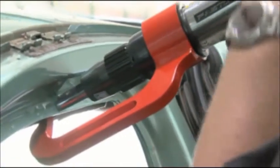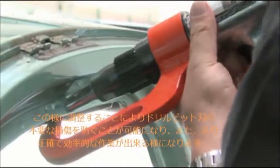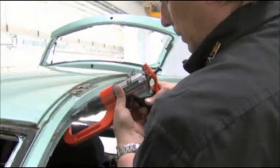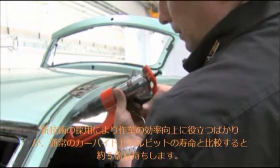The Fast Drill is set up to start rotating only when the drill bit touches the surface. This avoids unnecessary shocks to the carbide drill bits, which are very fragile, and results in a much more precise working process.